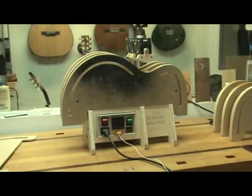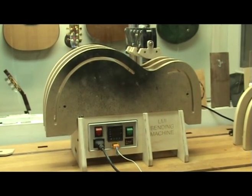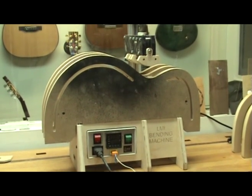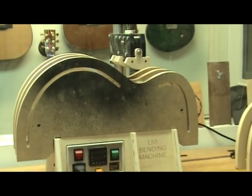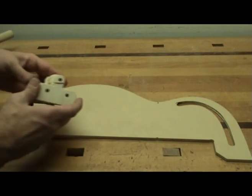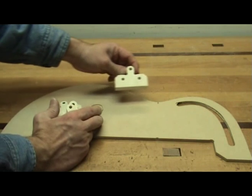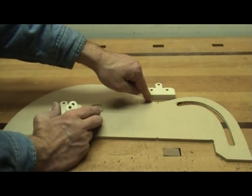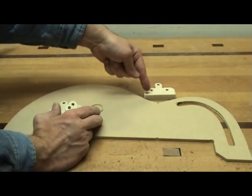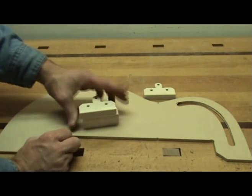Here is my brand new bending mold that I made for my custom shape for the LMI side bending machine, and it's almost ready to go to work. The only thing I need to do now is make some custom shoes to match my custom shape at the waist. Along with the template blank from LMI, I was also able to get some shoe blanks. These can be placed under the template right at the waist where I marked that line and traced the contour. I can then make that shape on my sander, install them on the side bending machine, and I'm ready to bend.